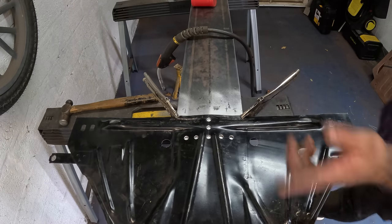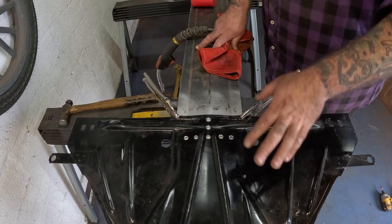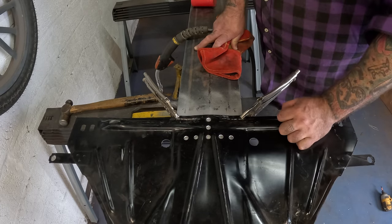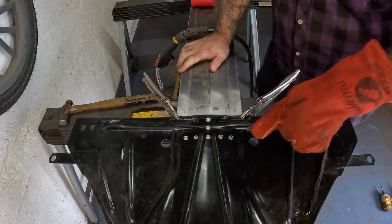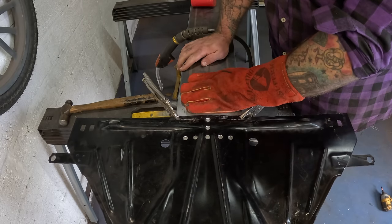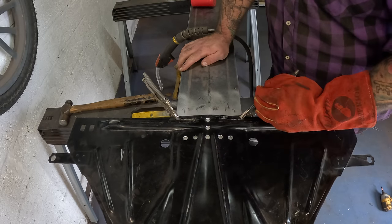Okay, now we're upside down again. We've plug welded all the way around the top, so this frame head is now connected. That's its final position dictated now. So if you're not already bored of watching me do plug welds, we've got some more to do in the bottom. They will connect this lower sheet part to this big beefy thick plate that we've put on the bottom, as that extends inside the frame head to about there. So this thing should be super strong.